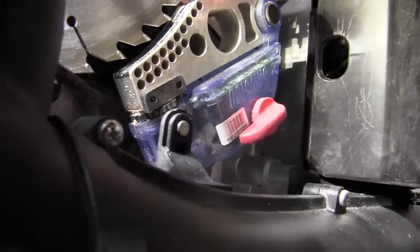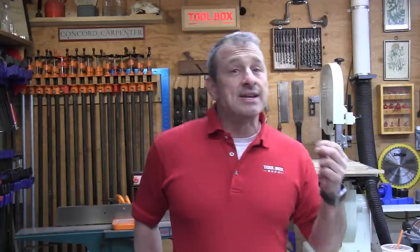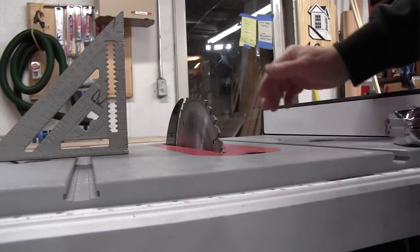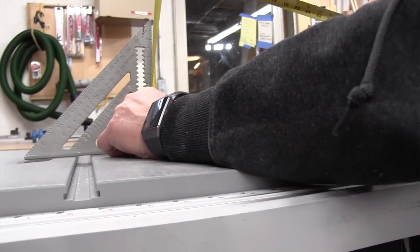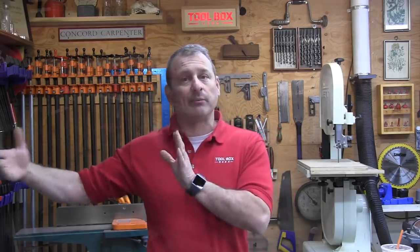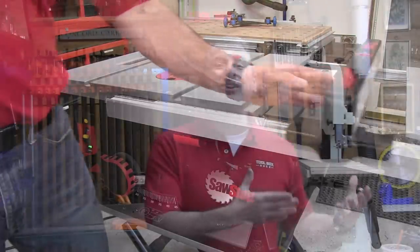After activation the saw needs to be reset, the blade replaced, and the SawStop brake cartridge replaced. The reset process takes about five minutes. The saw has a 1.5 horsepower motor with a 10-inch blade, weighs 79 pounds — 108 pounds on the stand. The cord is nine feet six inches. It bevels from zero to 46 degrees, giving a 3-1/8 inch cut at 90 degrees and a 2-1/8 inch cut at 45. It rips 25-1/2 inches to the right and 9-3/4 inches to the left of the blade.